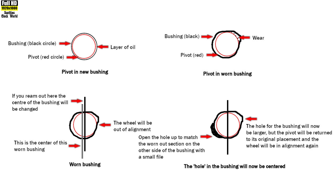In the pivot-in-worn-bushing example, there is wear to one side of the bushing so the pivot is starting to move around within the bushing. This happens when a clock movement is not maintained and oiled every three to four years — the drying oil collects dust over time and becomes a grinding paste between the bushing and the pivot. Pivots are made of steel and bushings are made from brass or bronze, so when wear occurs it happens to the softer brass and not the pivot. It is far easier to replace a bushing than to replace a pivot.